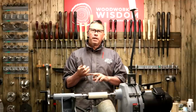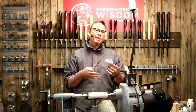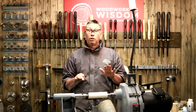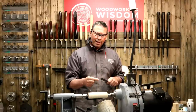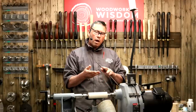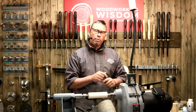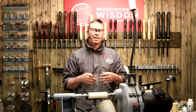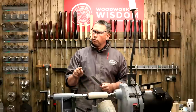When it comes to finishes, you'll have several guidelines on the tin. There'll be toy safe. There'll be food safe. Toy safe is fine for toys if they're going to be put in the mouth, so once dry, they've been deemed safe to use. This sort of thing, I personally wouldn't really put a finish on. Again, I've looked, and what they recommend is the natural oils. So things like tung oil, bear in mind it's a nut, lemon oil. One of those natural oils, okay? Walnut oil, again, it's a nut, so be careful. But I wouldn't put things on like sanding sealers. Shellac, it's a natural product again, but just check what other ingredients have gone into it. I would just keep them fairly neutral. Well, I'm going to talk woods in a minute as well.